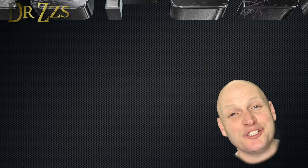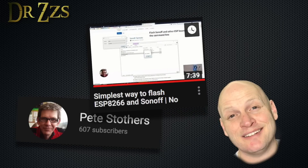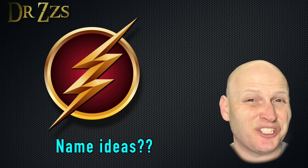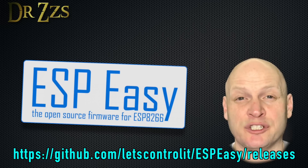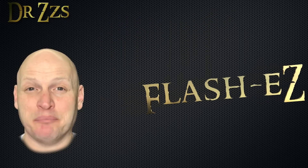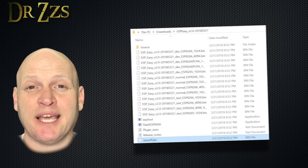Instead of using the Arduino IDE I'm gonna show you how to use Flash ESP8266. Full credit goes to my friend Pete Stuthers — he didn't invent it but he put out the first video I saw explaining where to get it and how to use it. Flash ESP8266 is actually made by the people who make ESP Easy. It's a simple little executable file that comes included in a zip file you can download. You can use Flash ESP8266 to load any binary or .bin file onto your Sonoff. I'm gonna use Tasmota so I go to the Tasmota GitHub page and download sonoff.bin. Make sure it ends up in the same folder as Flash ESP8266.